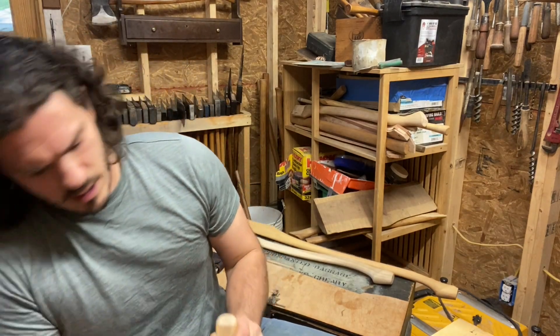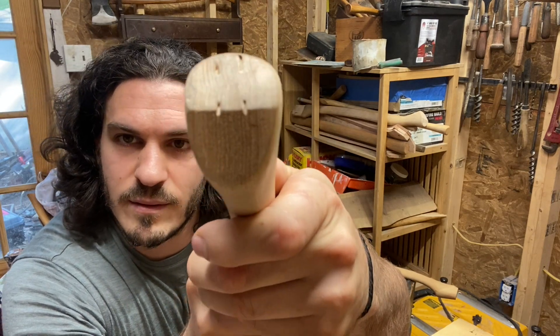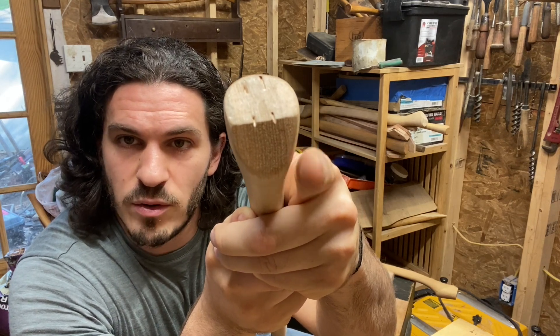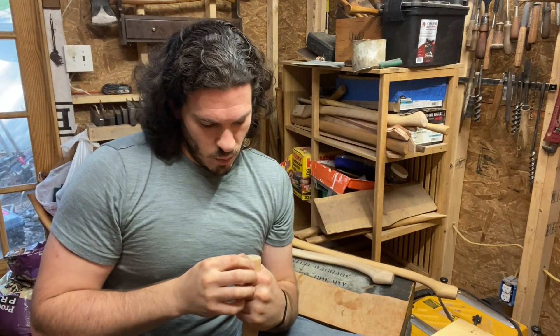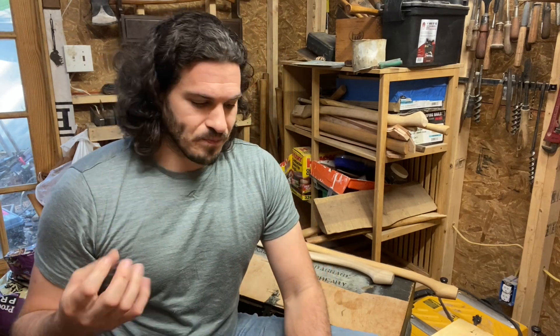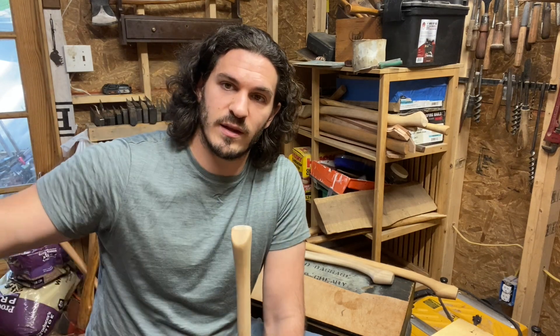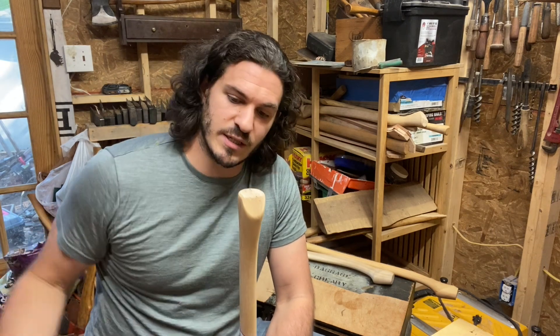If you see the little dots on the handle, those are little holes — those are the early wood vessels. When a tree is growing in the spring, everything grows very fast and quickly. In a ring porous species like hickory — and this applies specifically to hickory — a tree will be growing very fast, saturated with water and nutrients, and accordingly it needs larger passages to send all of that up the tree. Those vessels solidify and stay the size they needed to be in the spring, so they're hollow, which reduces the density of your handle.